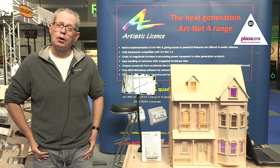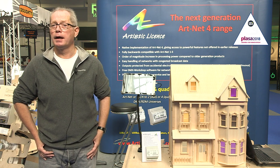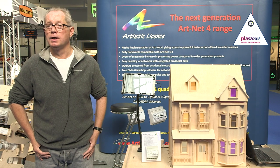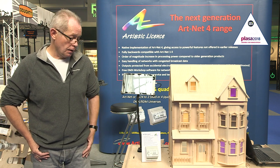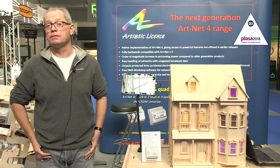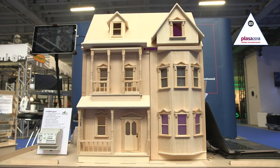Daligate Quad can operate in two different modes. The first is the streaming method, where you're streaming ArtNet or sACN out of your production lighting board and that's converted in real time into DALI. The other operating mode is scene playback. One of the key features of DALI is that all DALI ballasts and drivers can record up to 16 scenes, which can be played back by a DALI scene recall command.